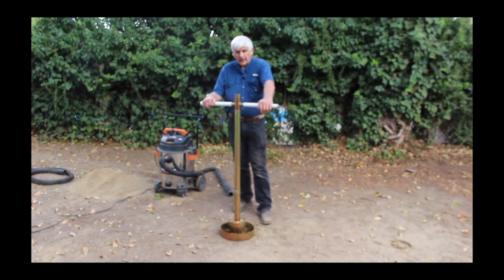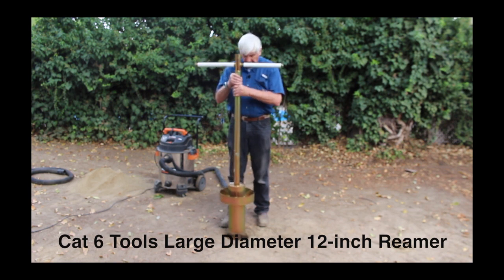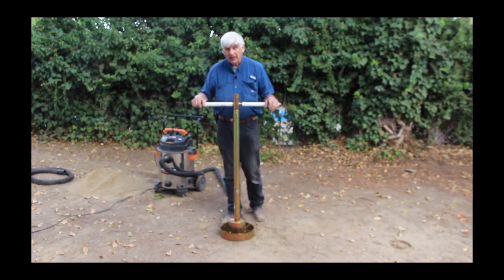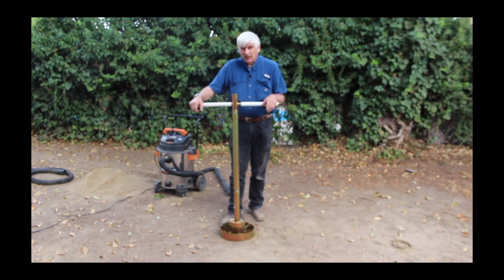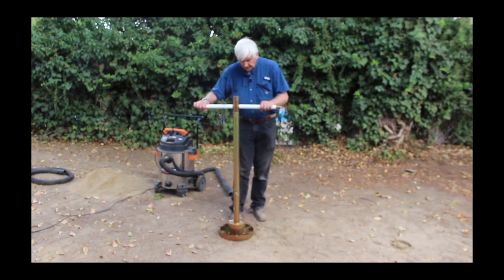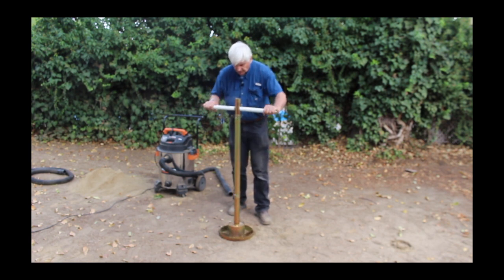What we're going to do is ream an eight-inch hole out to 12 inches. This particular reamer has a guide on it made for six inch, but we've already reamed it to eight. It's going to act as a little bit of a weight to help us get this hole started and centered. Once we're centered and we've gone down about two or three inches, we don't really need a pilot or a guide. So I'm going to wobble this thing back and forth until I get it started. You can see the saw blades starting to get into the ground.